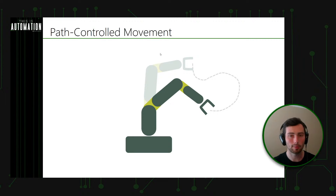The opposite is a path-controlled movement. Many robotics applications are path controlled because it's often very important not just that we move to a specific point, but that we move there in a specific way. Consider a welding application: we want to start here and end up there, but we must follow a very specific path. If we're welding a piece of metal with a particular contour, we can't just go straight across. Path-controlled movement also adds complexity when accounting for safe workspaces that the robot must avoid.